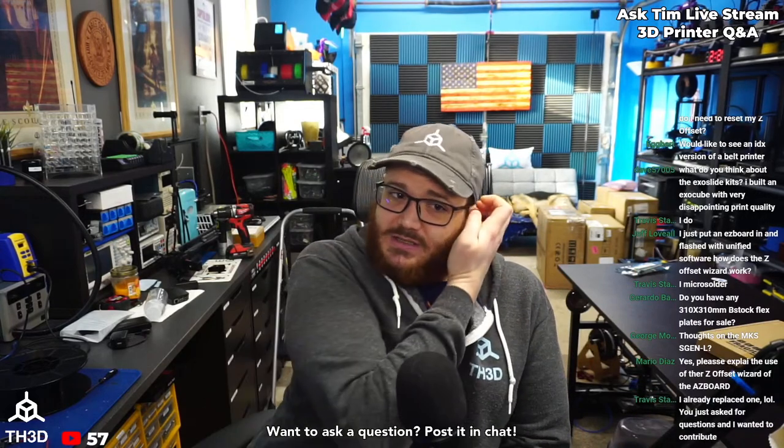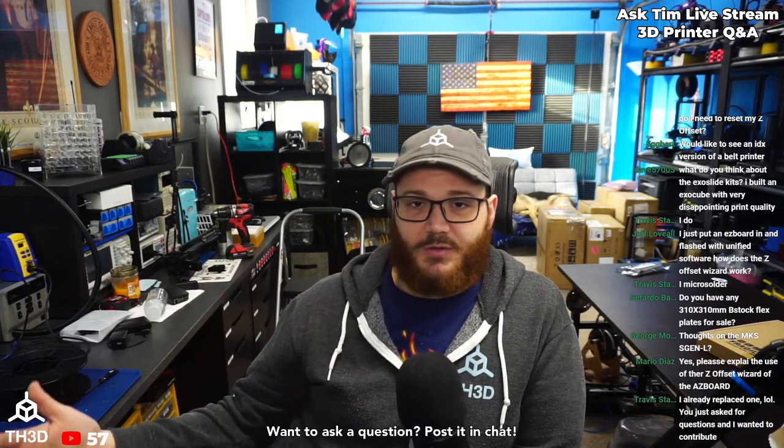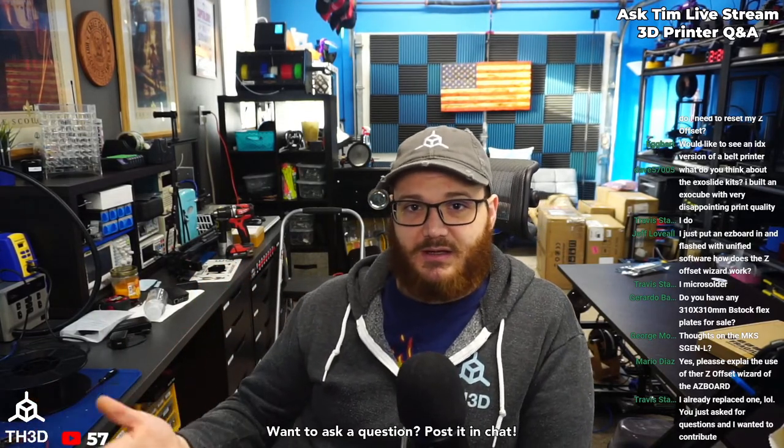Mario says, any recommendations to turn a CR10S into 24 volt? If you're converting any machine, you've got to replace the components that are basically limited to the original design voltage. So like the heated bed, the heaters, the fans. You would have to replace the heated bed heater, whether that's putting a silicone one on or completely replacing the bed with a 24 volt one. All your fans, your heater cartridge and your hot end. So that's the kind of stuff that's usually voltage specific.